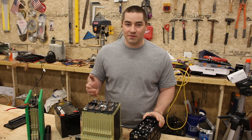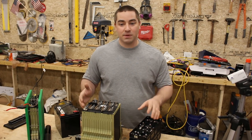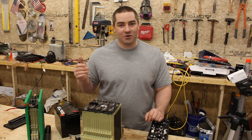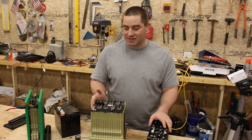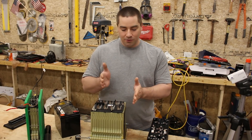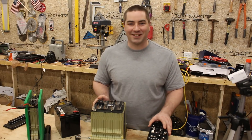I really hope you guys enjoyed the video. I tried to make this topic as easy to understand as I could. When I made my first Powerwall out of a Chevy Volt battery, I just did it in 12S because that's how Chevy put them together. But after I had built the battery and had it up on my wall, I had the struggle of trying to find inverters and charge controllers that could work with it — and that's what got me on the kick of trying to learn about cells in series and what the ideal range is. I hope you can learn from my mistake. Knowing what I know now, if I was to build another one out of Chevy Volt cells, I would take the extra effort upfront to reconfigure the cells to 14S. Thanks a lot for watching — please like, subscribe, comment, and share. Check out the links in the description below if you'd like to help support the channel.